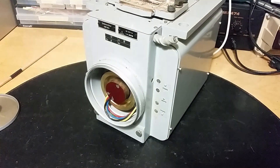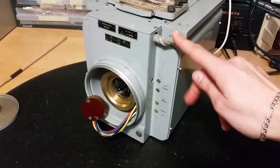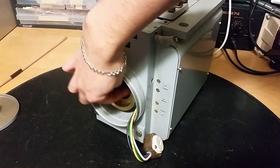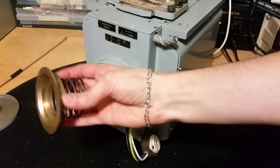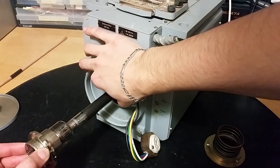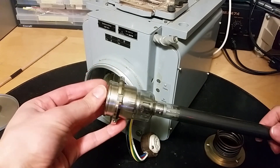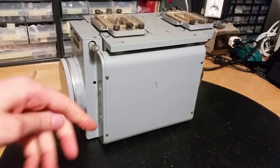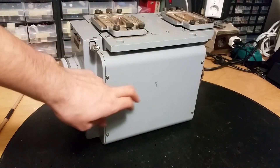That was the lid. And here's the connector. These wires are actually connected directly to those wires up here. This is a spring-loaded disc that holds it in place. This spring here, this brass. Let's remove the tube. And here's the traveling wave tube - RW3. So now the tube is removed, and I will remove these plates from the sides - one here, one on the other side, and one on the top here, so you can see how it looks inside.